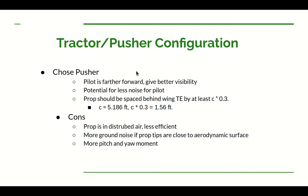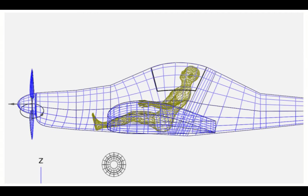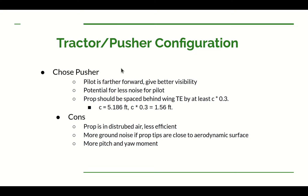Dan notes that many things in this chapter need to be considered earlier in the design, and tractor versus pusher configuration is one of them — so the book isn't strictly step-by-step. We decided early on to go with a pusher configuration. With a pusher, the engine is generally toward the trailing edge of the wing, which means the pilot moves forward to balance it. With a low-wing configuration and the pilot farther forward, that gives better visibility to the ground.